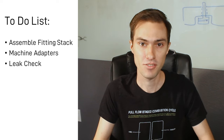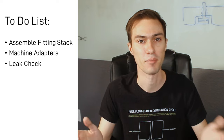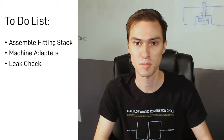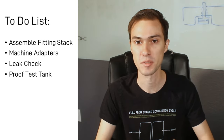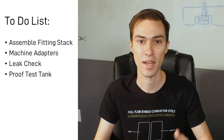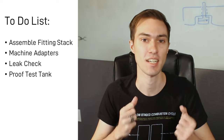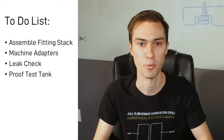To do that, I'm going to have to machine a couple of parts for the first time, and then after that, I'm going to have to conduct a test to make sure that all those parts I just assembled meet requirements and will perform as I expect them to. Once I've leak-checked the fitting stack that goes on top of the tanks, I'm then going to have to proof-test the tanks. Proof-tests allow me to demonstrate that the tanks will be safe at the pressures I intend to operate them, while also doing it in a way that is safer than if I were to just put them straight on the test stand, fill them all the way up with fuel, and then pressurize them up to operating pressure.